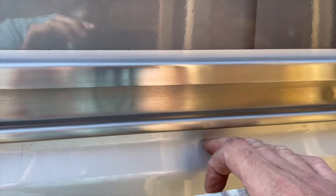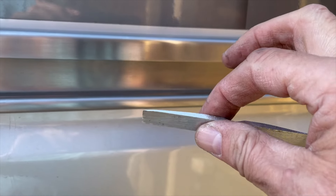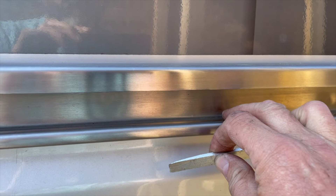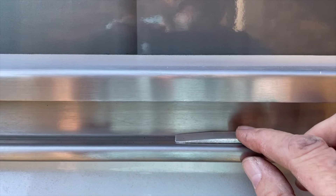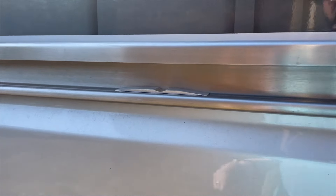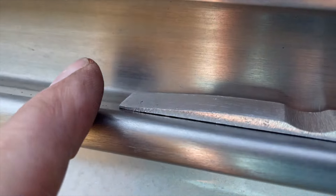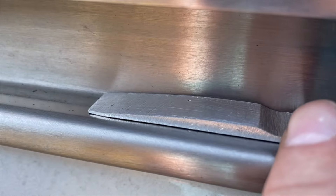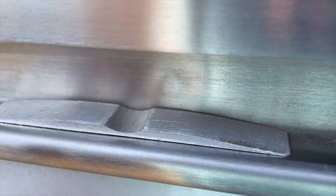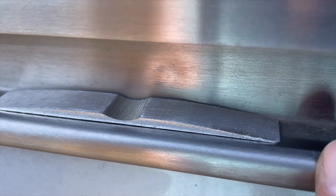You could apply this device we've just made to any one of those three tracks. I'm actually going to use it on the middle one, even though it's the most visible — our device is going to be practically invisible, same sort of colour as the stainless steel track, and of course it's really easy to see what you're doing and position it correctly. Our little roller is now going to roll up the ramp and settle in the divot in the middle, and I can push it further and it'll roll down the other side — that gives us our extra detent or holding position for the door.